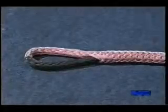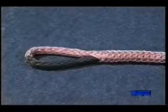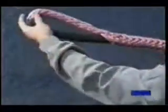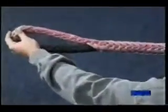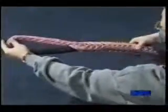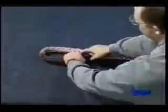The buried eye splice is the simplest. The tail of the rope is simply buried into the standing part for a certain length. The buried eye splice works on the principle of the Chinese finger lock, which means there's almost no distortion along the rope. This almost complete lack of distortion gives this splice the highest break strength. But the buried eye splice can easily be pulled out simply by pulling on the tail end, like this. Obviously, the buried eye splice should never be used in the field.